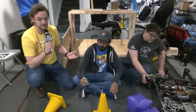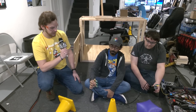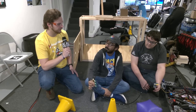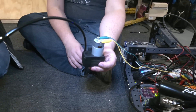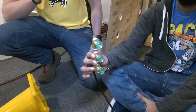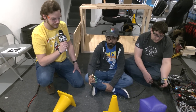It can go on the end of multiple applications, and it also could probably go onto a chassis bot if you just want to drive into game pieces. This vacuum pump is a 6-watt, 8-liter-per-minute, 120 kilopascal pump from Amazon, and we're using suction cups from AutomationDirect attached to a variety of standard pneumatic fittings from AndyMark. We don't know if three suction cups is necessarily the right amount, but one was too few and three works, so feel free to play around with that.